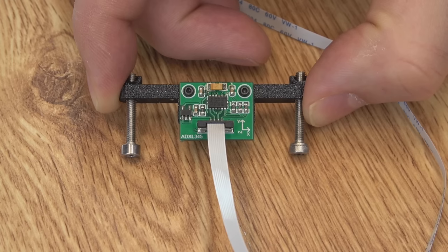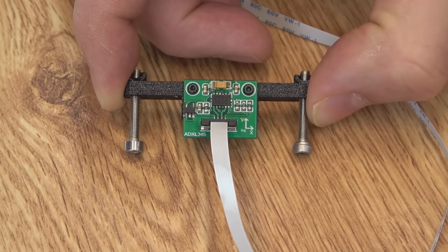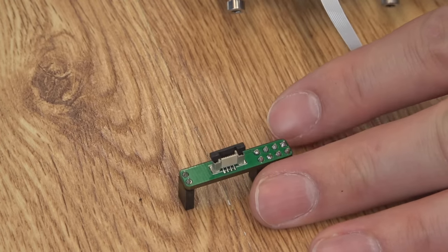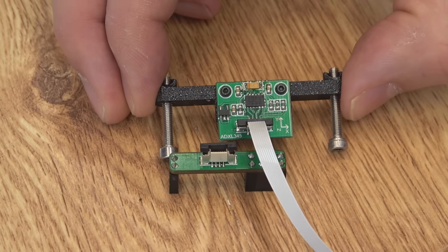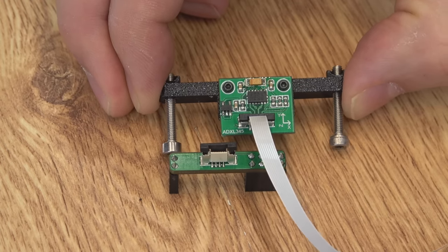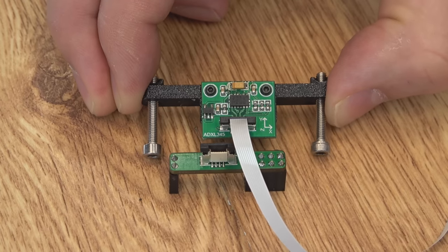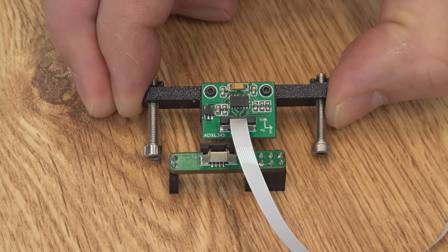I got mine with my Switchwire kit from LDO. This one has a module with the accelerometer, and you can use this ribbon cable over to another module that plugs into your Raspberry Pi's GPIO pins. These sensors are used with the SPI interface. There are a bunch of different ways to get this done — you might have to create your own wire loom or purchase one of these kits. I highly suggest you get one that's pretty easy to use with your Pi. There are a lot of boards that already support these with GPIO headers or a port you can just cable up with something like a JST.